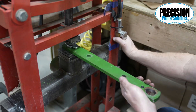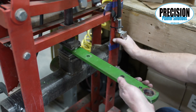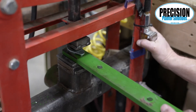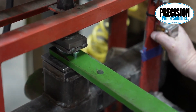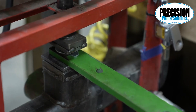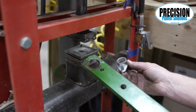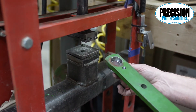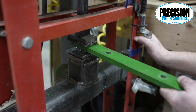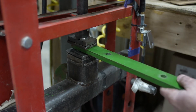When you are sure which way to press the bushings in, you're ready to start. A hydraulic press works best and it has to have a flat surface to press against the bushing. Make sure the bushing lines up with both holes, then drop the pin in the hole, slide it under the press, and press the bushing in. For inside mount arms, you can just flip the top arms over and press one in from each side. On the lower arms, if they are inside mount, place the pin in the hole on the bottom and then press it in. When you have all bushings pressed in, you are ready for our next video.